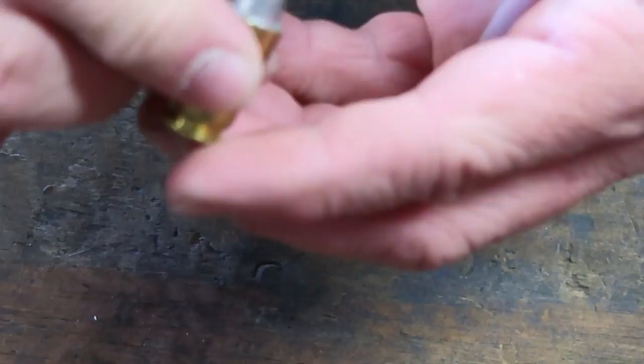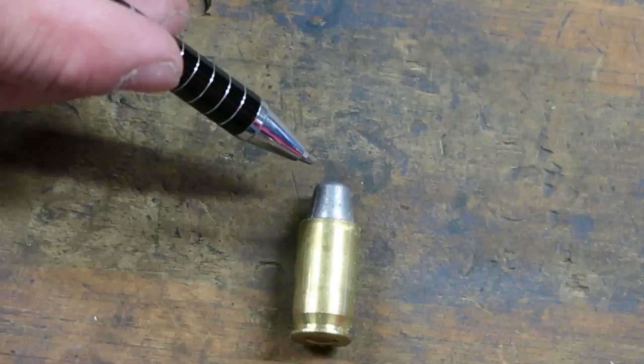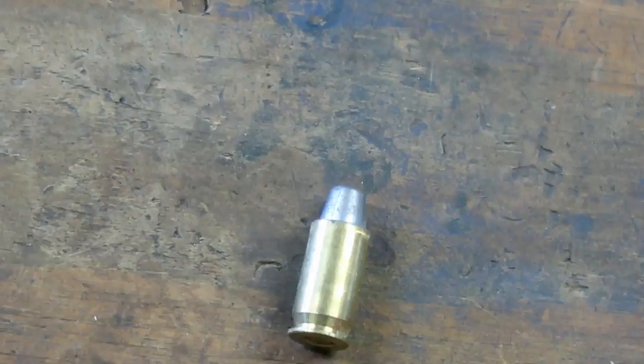There's a very short feed lip version for this type of bullet right here — that is a wad cutter. It has a truncated, very sharp, steep angle and is generally a lead bullet. These were cheap to make — cast bullets, you can make them yourself. It has to release very quickly because if that lead hits the ramp, it's going to stop and jam up. So they had very short feed lips, but the gun had to be modified in order to shoot these correctly.